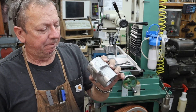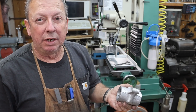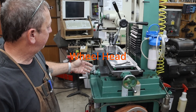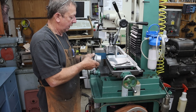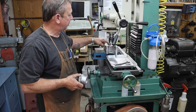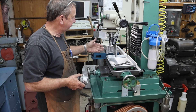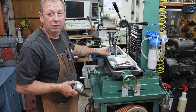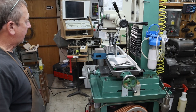We've got this part done that goes on the column, and we're not going to do any more on it until we finish with the motor mount because it hooks into it. So I've set it up sideways — I want this to sit in a little bit farther for the adjustment screws. I've leveled it back up so we're parallel and perpendicular, set up the boring head, and I'm just going to bore on back and relieve both these radiuses top and bottom.